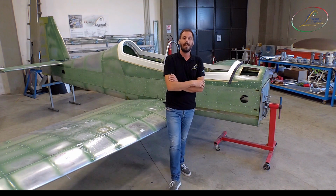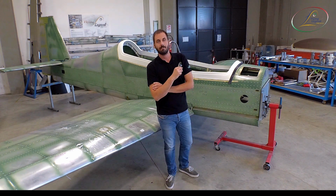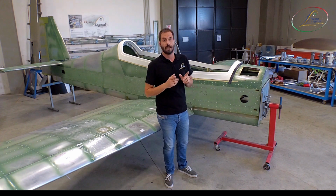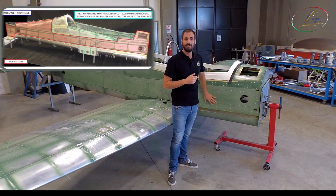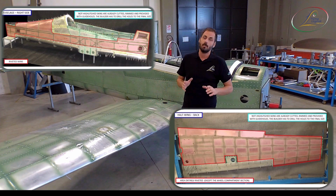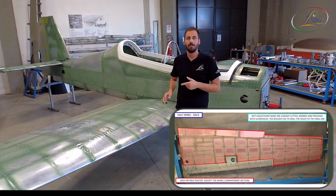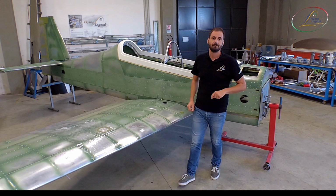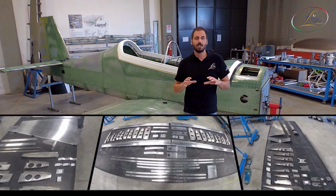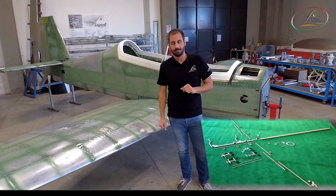The advanced kit has an estimated building time of 800 hours. Our assistance builder program will give you the possibility to move forward in the construction of your kit. In particular, the fuselage will be riveted in the central area, and the same applies to the half wings, within which you will need to insert the aluminum fuel tanks and then prepare the coupling to the fuselage. Flaps and ailerons will be completely riveted, while the empennage will be disassembled, as well as the flight controls and all the rest of the kit.